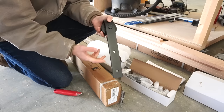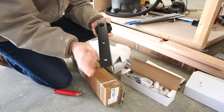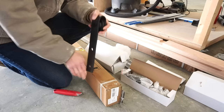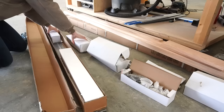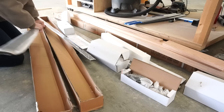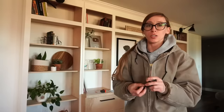The rolling ladder hardware was a lot more expensive than barn door hardware. The main difference I could tell was that the ladder hardware had bent brackets for the ladder to lean at an angle. I ended up using sliding barn door hardware instead — this may not be your typical way of doing this, but I think it'll work. I've made my own rolling door hardware before, but this time I bought a kit online. My overall project width was about 13 feet, so I bought a 12-foot rail and followed the included instructions to install it.